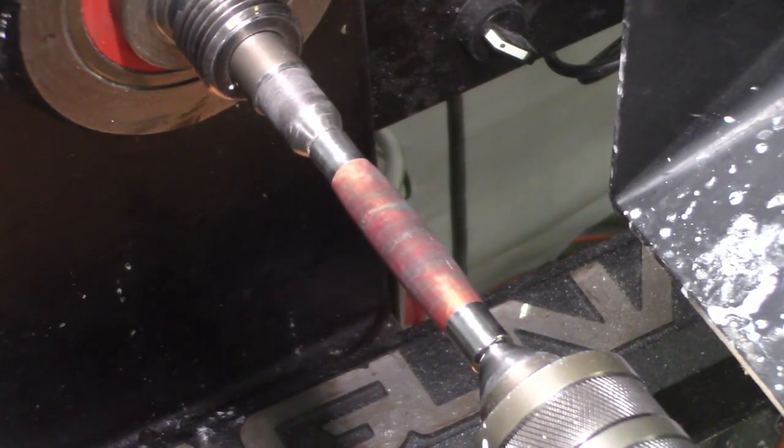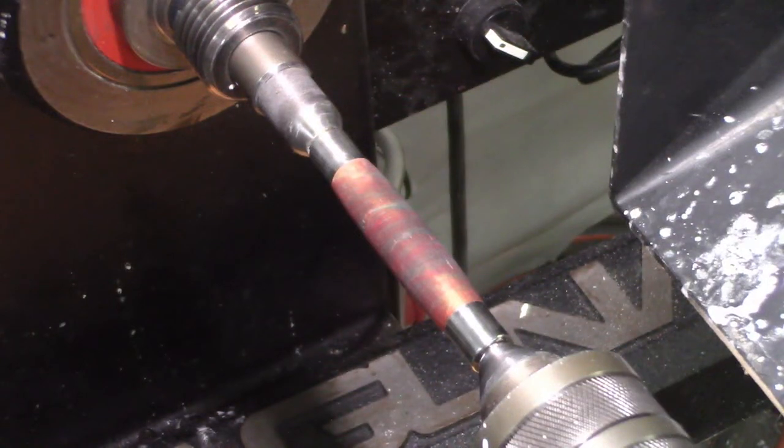Let's see here. What do the directions say? They recommend wet sanding up to 2,000 grit. And then it says, however, stopping at 800 grit is acceptable. The one thing that I differ from, they recommend spinning up your lathe to like 2,400 to 3,000 RPMs. I just don't really think that's necessary. They say polish sanded item with mild pressure for 20 to 60 seconds. I'm sure there's a few different ways of doing this that all work.